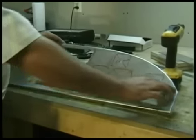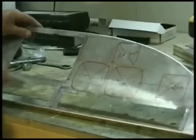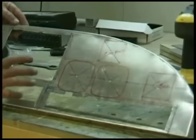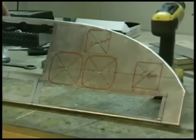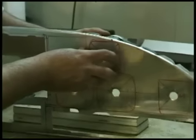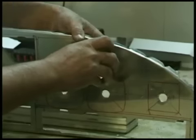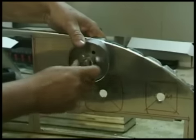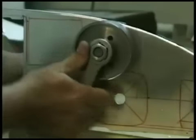The nice thing about this is it's a very simple, very basic system. What I always do is I'll centerline the panel in both directions, because now I know where things are going to be placed relative to each other before I even try and sit in the airplane and check it out, but I know roughly what's going to be in the center. Just set that through there, just in through the hole, and then I'll put this one up in the front, and I need a spacer along with my nut.